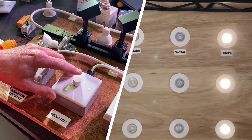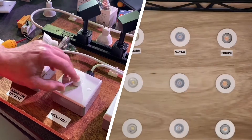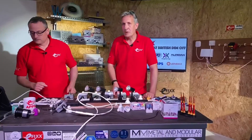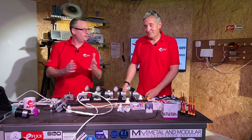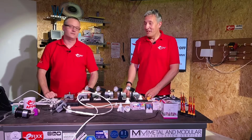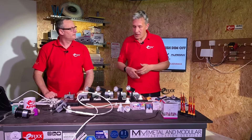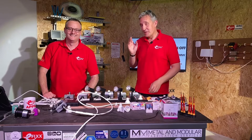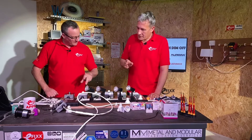Once you've got it, confirm full brightness and the low end as well. Always switch off and back on again just to make sure it has stored it. Know your dimmer, keep the instructions — if it's your go-to dimmer you'll be pretty familiar with the button pressing. On the Selectric there are also combinations to set leading edge or trailing edge — they have three modes of operation — and if you completely mess it up there is a reset to factory default option.